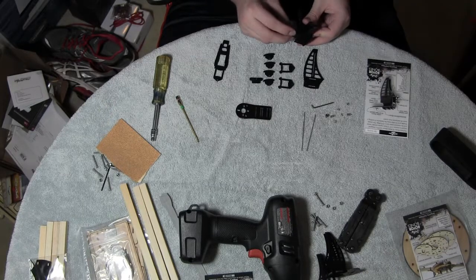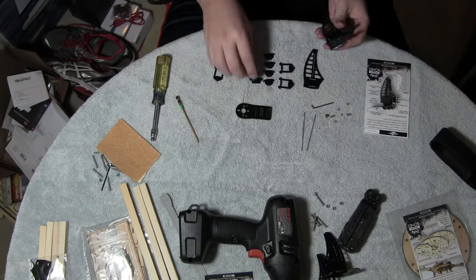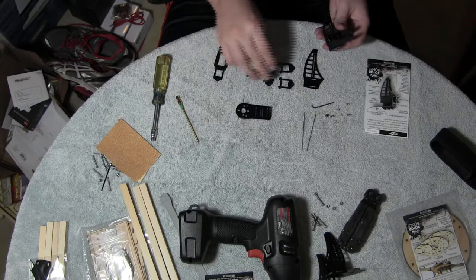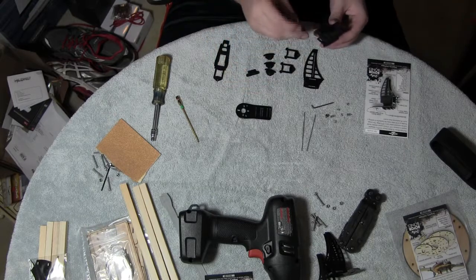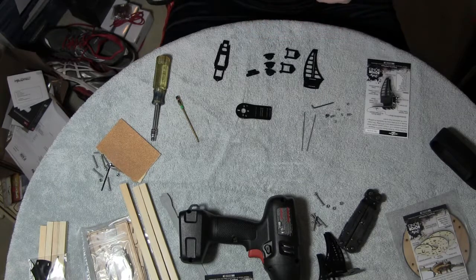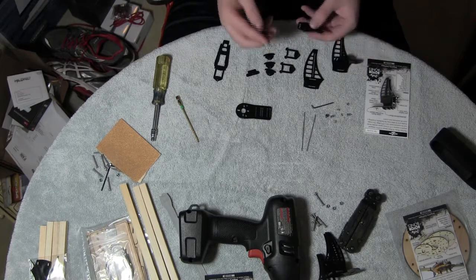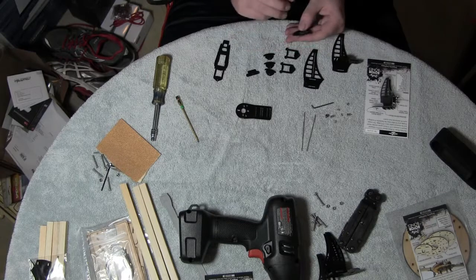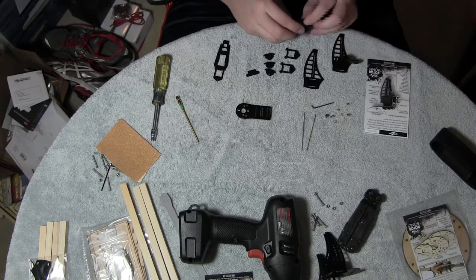There is a servo mount for this that you use. It's just going to be a little 9-gram servo that we'll be using. If you have the extra cash, definitely go to a digital servo with it. It will be a higher resolution, so as you're tilting the yaw back and forth, it's basically going to feel nicer, and it won't be as steppy, I guess you could say.